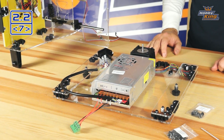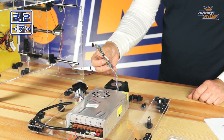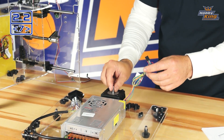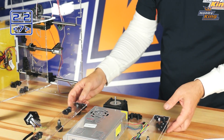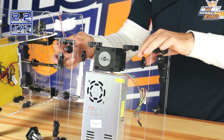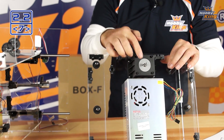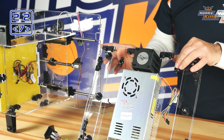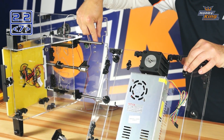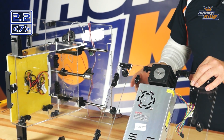Right over here is our Z-axis stepper motor, and it's a bipolar motor, so there are four wires coming off of it — two individual phases. When we assemble and slide this up, there are three points that need to make contact. These two little inserts line up with our lower rods, and this shaft needs to be inserted into this collar. As we slide it up, we need to make sure these are flexed and aligned just right in the assembly process.